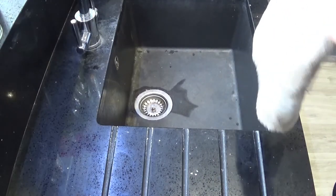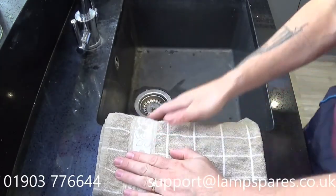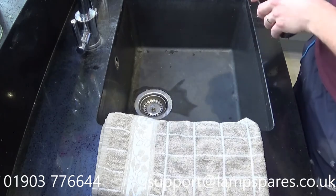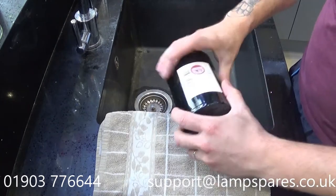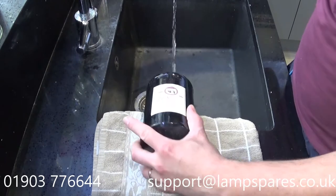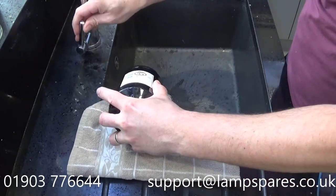The first thing I'd do is just grab a towel, fold it in half a few times, and just lay it down to protect the edge on the bottle. Because obviously what you don't want to do is put a bottle onto a hard surface. I can then have the bottle like that, run a bit of water, and line it up, and then I can start drilling.